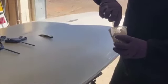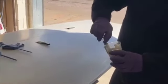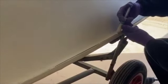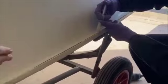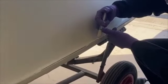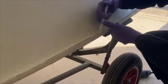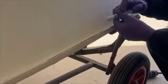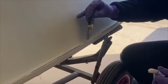So Matt is just pulling up quite a bit of that mix now. And he's getting a lot. We try to get the nozzle in between in there and inject it in. As I said, what it will do is flow down, because the bonding paste is quite a way down that gunnel. It's not just on the top surface, and that's the big question. And we even sometimes stick a chisel or something into the broken bond to force it open. I'm just going to poke it down. And so that's literally what he's going to do.